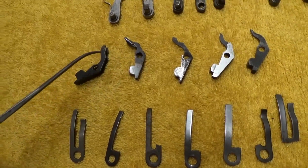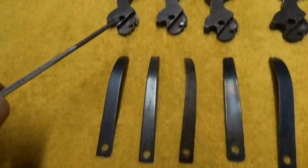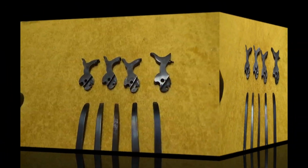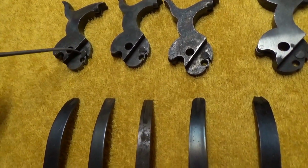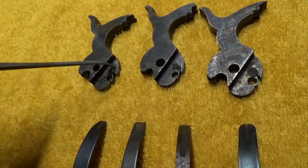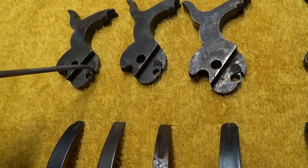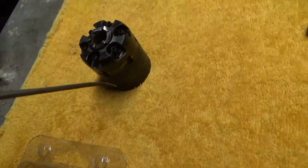The purpose is that one of them rides up against the side of the frame, and the other one has to bounce over and then slide down this cam on the hammer. So if one of those legs breaks off, there may not be enough pressure to keep that hand along this section here of the cam, and the cam here on that leg moving out on the cam is what lowers the bolt and frees up the rotation for the cylinder.